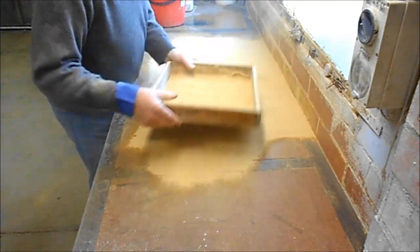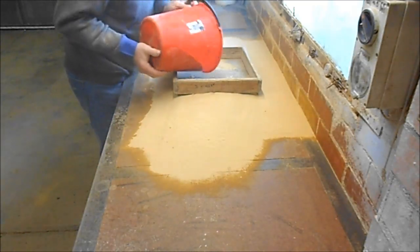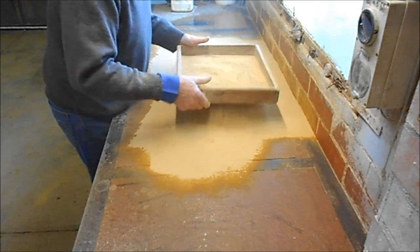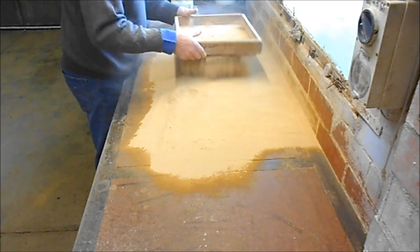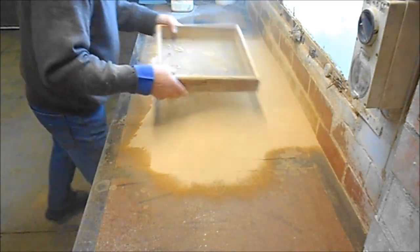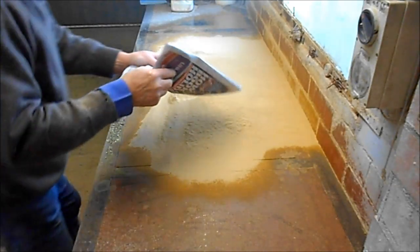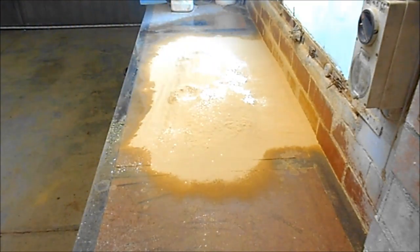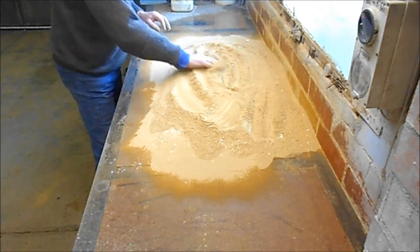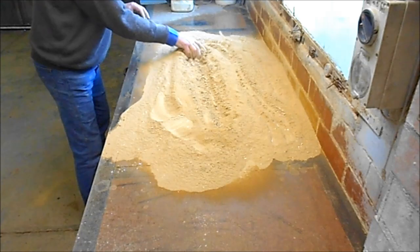This is quite a fine sieve — about half a millimetre gaps, maybe a bit more. Even though the sand's just been ground, it's surprising how many little bits of stuff it seems to pick up, so this just gets rid of those. The other thing about sands of course is that as they get older they need less water because some of the clay burns out. At this stage, a small amount of corn flour is added as an anti-expansion defect additive. Wood flour is the more traditional but I don't happen to have any. Normal wheat flour doesn't seem to work as well — it produces a somewhat unpleasant surface on the castings.